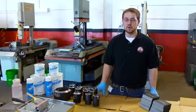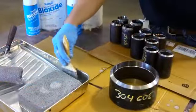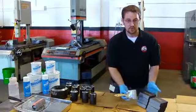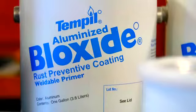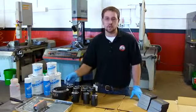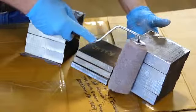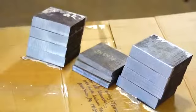Block Side is meant for carbon steels — mild, low carbon steels. We have plate coupons as well as pipe coupons and a few different ways of applying them. The simplest, most direct way is going to be brushing it on — we can brush it right onto plate coupons. A gallon of Block Side is going to cover about 800 square feet and goes on about one mil thick, making it a very cost-effective way to prevent rust on materials that need to be welded. The dry time is going to be around six to eight hours depending on your ambient temperature.